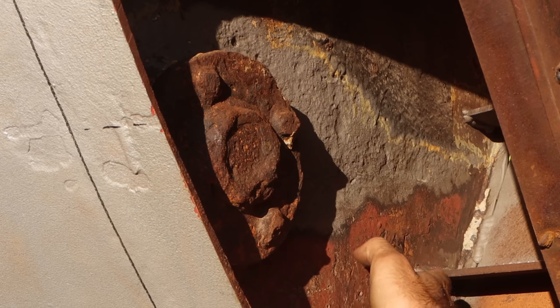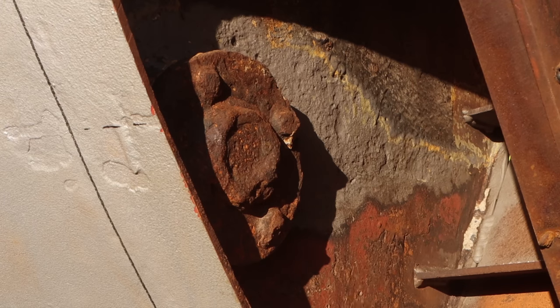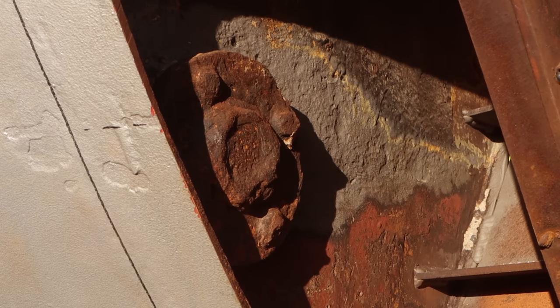It's annoying I run out there, but down here is pretty good. I've ground into it to weld onto it, and there's nothing really that's dramatic down there. I'm not too worried about that. Again, much like up here, underneath the cement was pretty good. But above the cement on that waterline was garbage, and that's exactly where we're seeing that pitting there. So I need to get in a bit more garnet, and I'll get some more blasting done on that before I can pad weld that up.